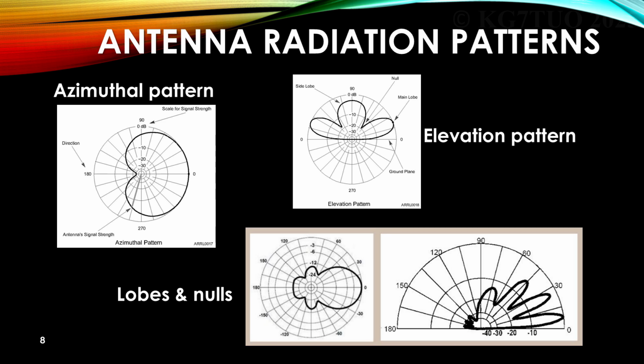By lengthening it. And this is a vertical antenna. Your car radio is probably a vertical antenna. Depending on where the antenna is mounted, you probably have some nulls and gains. So if you live by the pass and you have it facing this way, it's because you mainly want to talk to people this way, but if you wanted to talk to California, then that's not going to work so well. You'd have to turn the antenna. You'd put a rotator on it.